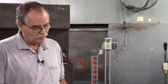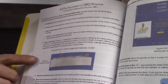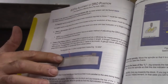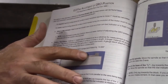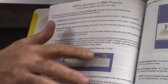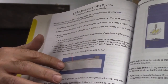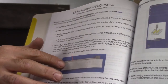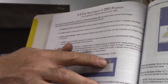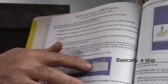Create a test fixture: an L-shaped block of material to act as a reference for measurement, as seen in figure 6.8.1. Here's your table, and you've got a fixture with a 12-inch known dimension and a lip. We're going to start here, zero our indicator, then command the machine to go 12 inches in this direction to touch that reference.